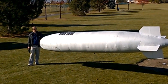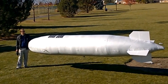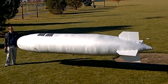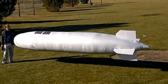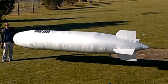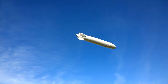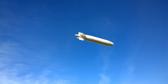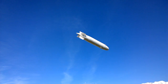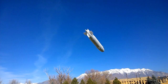Next, we have the solar cells themselves. We have a few options when it comes to the solar cells. This type is best for low altitude work, where you can't rely on having full sunlight all the time. These cells continue to produce power even with indirect or partially obscured sunlight, so when a cloud passes overhead, you still get some power. You could also use high peak solar cells, which provide higher power in direct sunlight but no power at all in cloudy conditions. That's really best for high altitude work, where you can fly above the clouds.